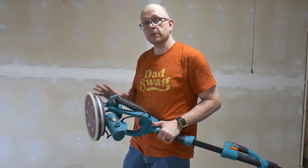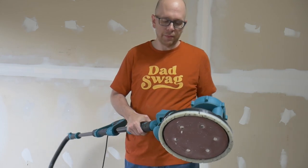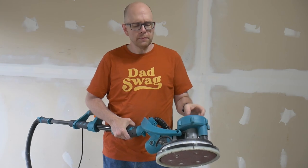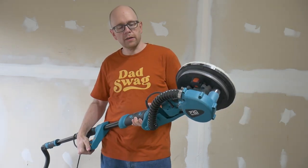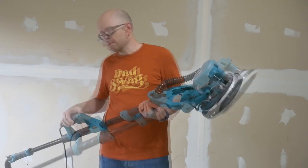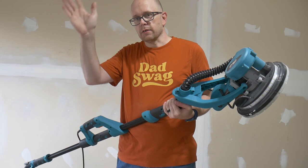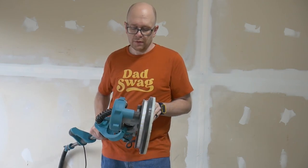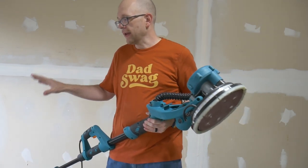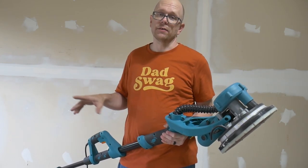All in all, I'm pretty satisfied with the way this performs. I think it's done a great job, and I do plan on using it for future projects. I've never used one of these types of sanders before, so I don't have anything to compare it to. But here are things I'm impressed with: first off is the build quality — it's made out of some sturdy materials and looks really well built, something a professional can use. You're probably going to be able to drop it a couple times without it breaking immediately. It gives you this nice light that casts at a shallow angle against the wall so you can see the smoothness of the wall and where you need to work. The dust collection is pretty adequate on its own, but adding a shop vac makes it ten times better. I had a lot less dust hitting the floor with the shop vac attached than with just the bag.